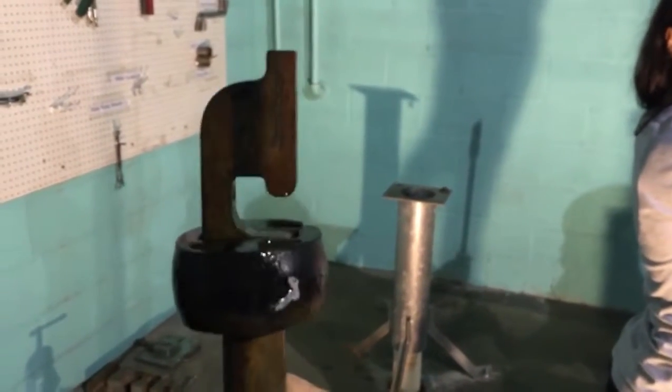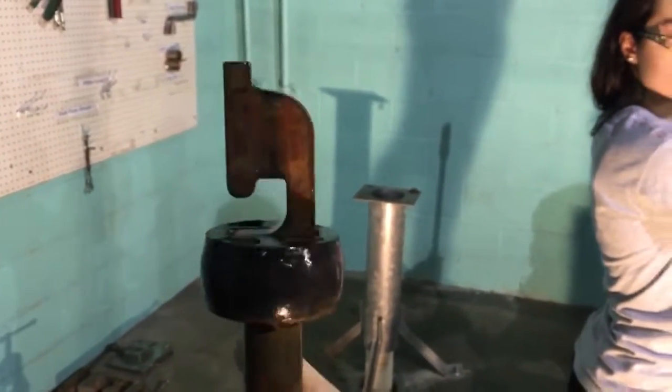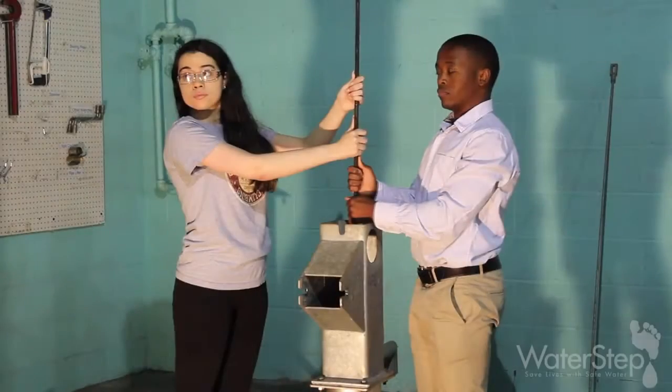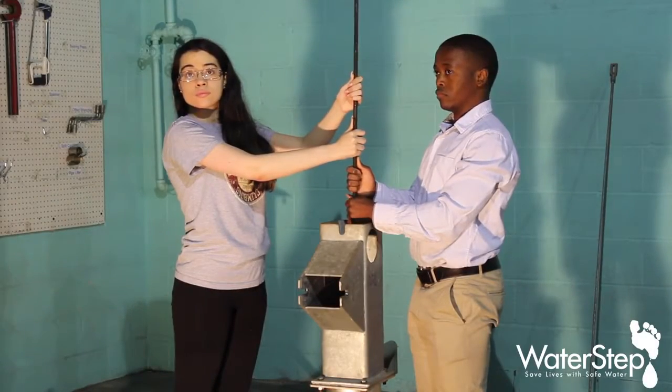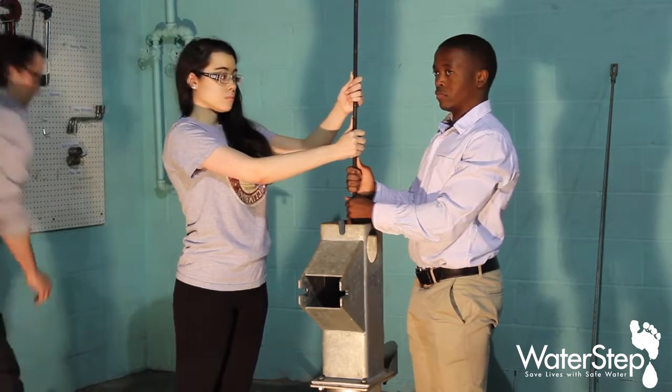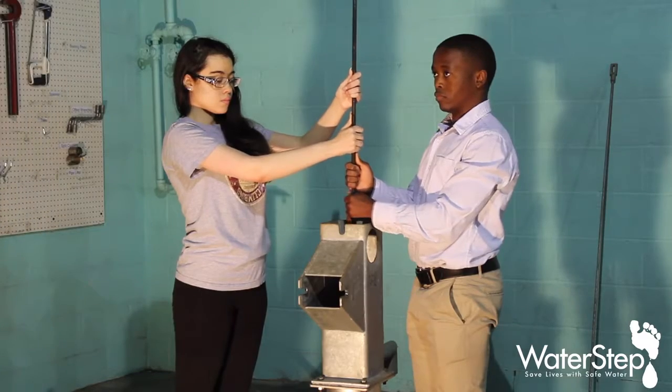Tell us about this little rubber device on the end of the sucker rod. The little rubber device actually serves two purposes. It keeps the sucker rod centered in your rising main and keeps it from rubbing against the side. Also, when you connect the sucker rods together, you can pull that down so that it locks the two together. So it's really kind of a dual purpose. Some of these are missing — that does not really keep the pump from functioning well — but if you've got them, it's a good idea to replace them as you're working on the pump.